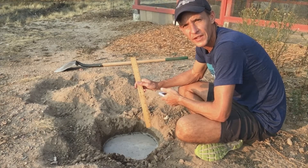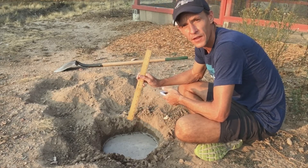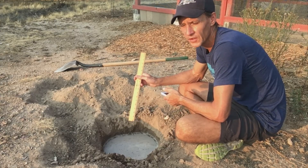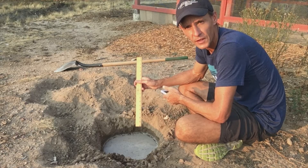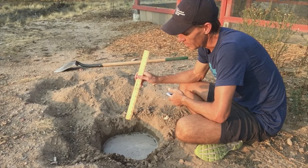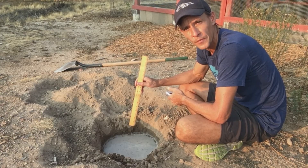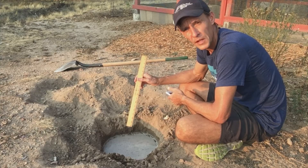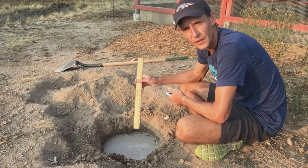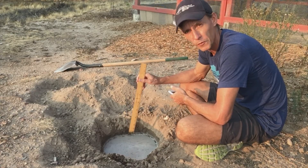Welcome back. It's been about 24 hours, give or take a few minutes. I've been refilling this hole for the last day with a bucket of water every few to six to eight hours — didn't fill it overnight — but now the surrounding soil is fully saturated, meaning it's really wet. Hopefully we've reached our limiting rate of how fast water can move through the soil. We're going to test that and take measurements three different times, all of which should be the same rate of downward water movement.